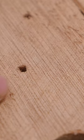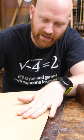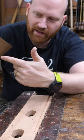You usually use it going across the grain, and it leaves this beautiful surface texture. The surface is left with a rough but smooth and flat finish that glue can bond to nicely. This is a traditional surface preparation before applying veneer — often before sawing the veneer, you would use the toothing on the back to put a surface on that as well, so the glue can mechanically bond to both.